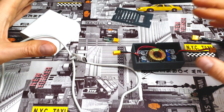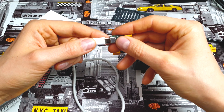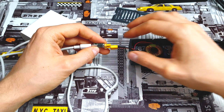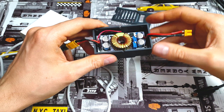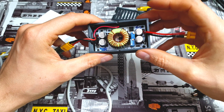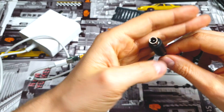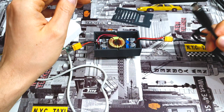So one more time — how does it all work? You connect the USB-C PD charger to the USB-C trigger, which gives you 20 volts on the output. Then you connect the USB-C trigger to the magic box, the step-up converter. You can then set whatever voltage you want on the output — from 20 up to 50 volts. Finally, the power output connects to whatever cable you want to use to charge your Xiaomi M365 or any other device.